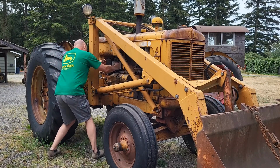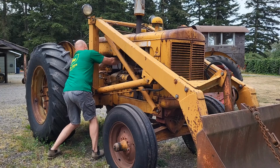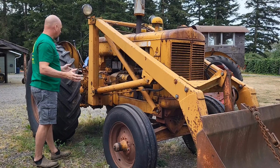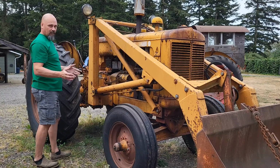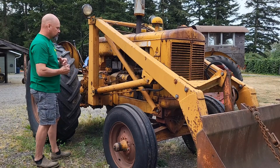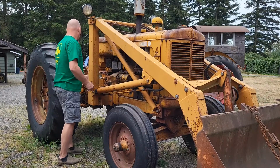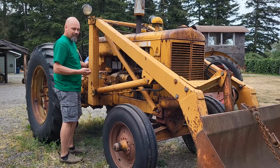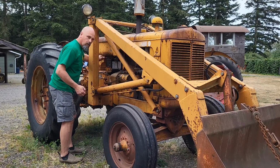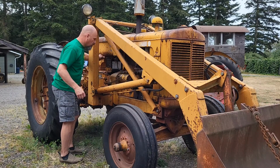Don't see no bees. And it shouldn't smoke. I don't see any. Okay, we'll hook up the ground. This is a positive ground system, 6 volt positive ground. Although, I don't know if you can see, but I got an 8 volt battery in there. Just a little more oomph. 403 cubic inches, I sometimes want a little more oomph, especially during the winter, right? All right, here we go. No spark. That's good. Maybe the water just crossed the wires and is creating the short itself.